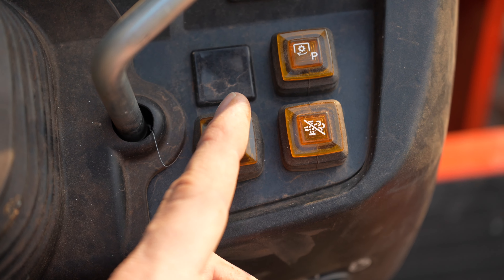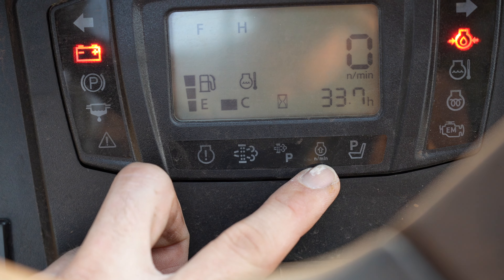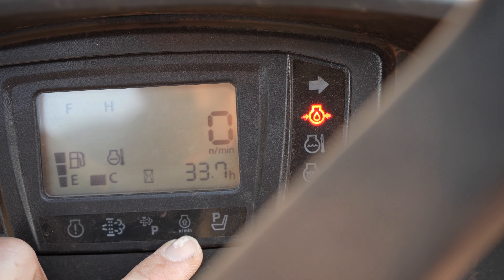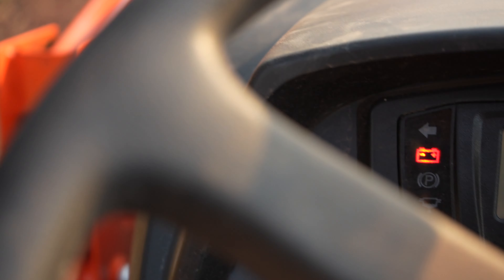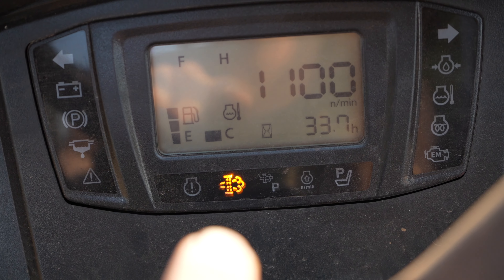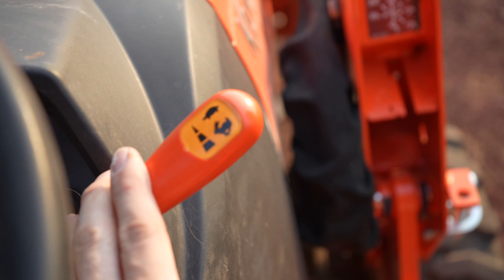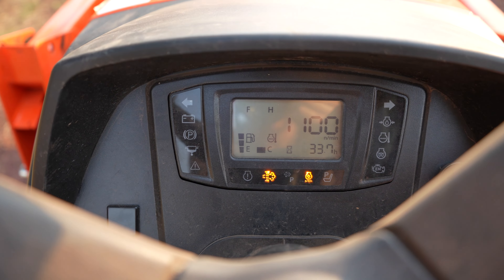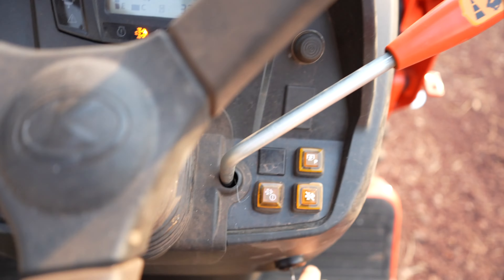If you want to run your PTO or emissions and park it, you can use this button here. Or if you want to inhibit your emissions you press this and it won't run the emissions cycle — that's for if you're just driving it for a couple of seconds and you don't want to go through the full emissions process, which is what I did today coming over here. Starting it up now — this display is telling you to raise the RPMs for emissions. If I hit the emissions inhibit button, it's still going to flash that it wants to do emissions but won't prompt me to raise RPMs. You can see the RPMs go up and down with the throttle.